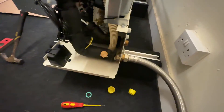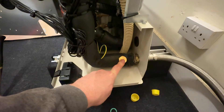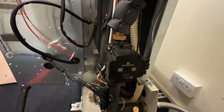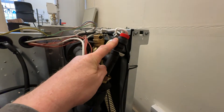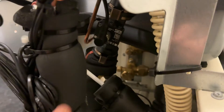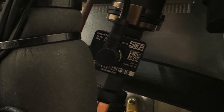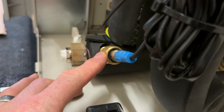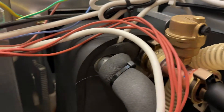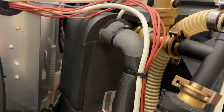You can also see on the back we have a seven-litre expansion vessel. This plug here is for if you put glycol in — you have to take it off and put a flow switch in there. It then comes to what looks like a standard central heating pump. Going up, we can see what looks like a pressure relief valve, and down underneath the unit you can see the flow switch. Around the front is a pressure sensor. Continuing at the top, we've got an automatic air vent and then our plate-to-plate heat exchanger, or our condenser.